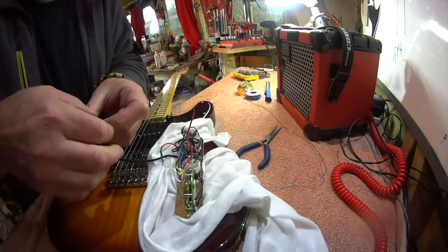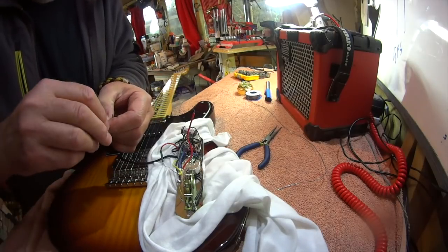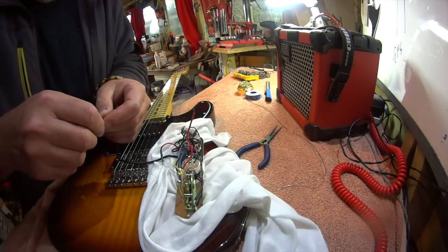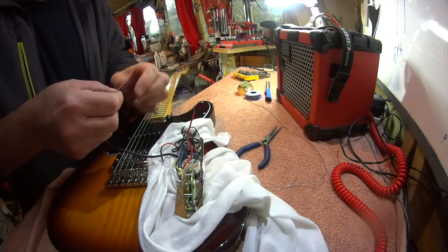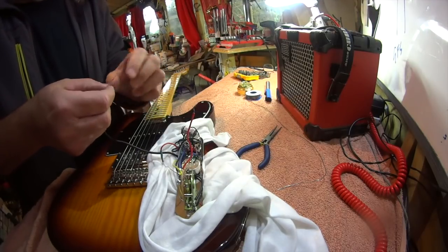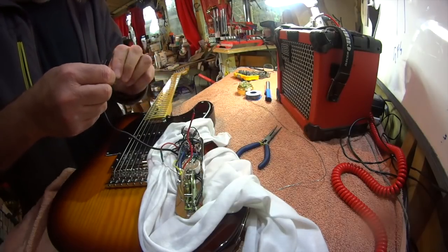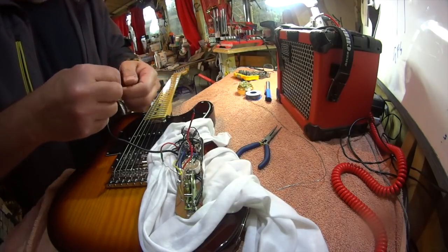This can, of course, take hours longer now than I hoped. So what I'll do is I'll set it up so I can experiment with doing exactly what I surmised was the right way to go about it, which is to switch output positive with the earth, which is currently looking as, well, the two. There's the casing, what do they call it, the case ground, or the pickup surround plate ground, which is the bare one. Oh, I cannot turn this. And then there's the black one, which is the ground in this pickup wiring configuration. So it's the black one we're going to switch out.